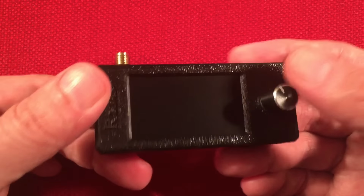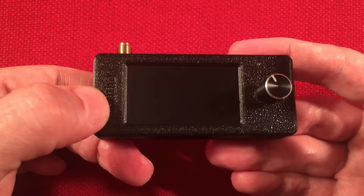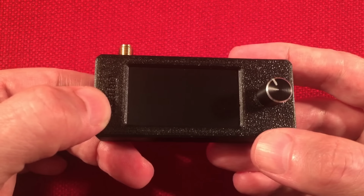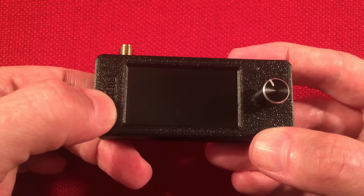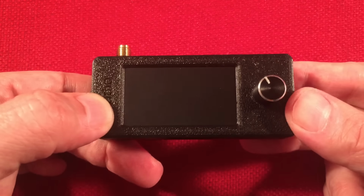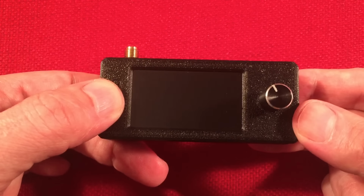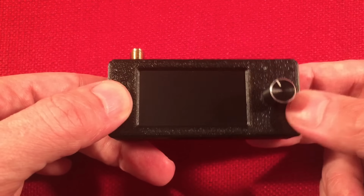If you get your radio and you press this down, the menu comes up and it goes away in a second or two, you've got the old firmware. If you press this and let go, the menu comes up and stays for 8 to 10 seconds, you've got newer firmware. Yay for you. Rock on. They helped you out. So I guess there's some floating around with new firmware. Great. But yeah, if you don't have that, you can update the firmware.